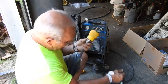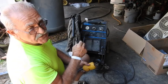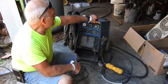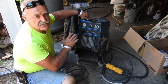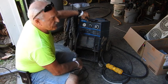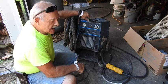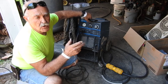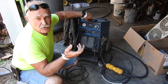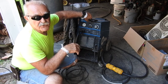This is just going to be a few minutes on single-phase, then we're going to go back to the original plug. I'm going to power up the plug, check voltage, make sure I've got the correct voltage, plug this in, turn it on, and see what happens. But I've got to get an air supply over to it first. Power supply is on, air pressure is connected. I don't know if this is auto-controlling with the pressure or not, but we're going to find out. I'm going to leave it set for 45 amps — this is a 55-amp machine. I'm going to try to cut a piece of quarter-inch metal. One thing to remember: these things give off a phenomenal amount in the blue spectrum of ultraviolet light waves, and the blue spectrum is the most damaging to your eyes, so you have to make sure you have the correct and proper eye protection so you don't penetrate your eyes with that blue-wave radiation.